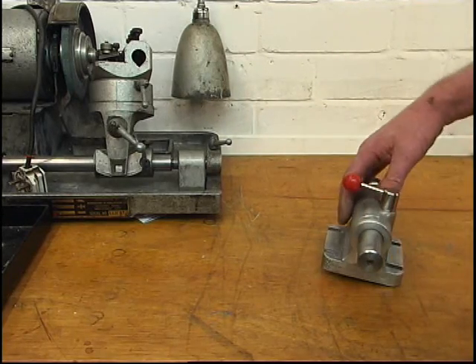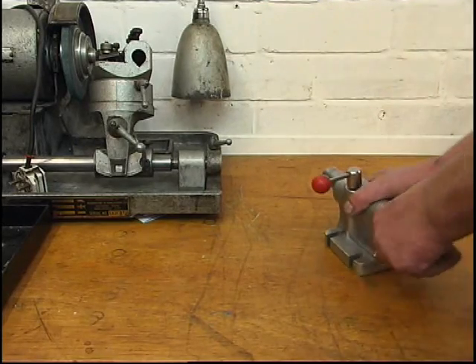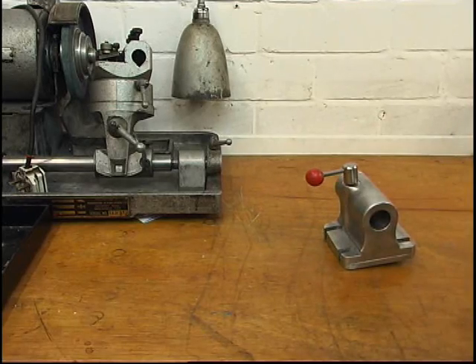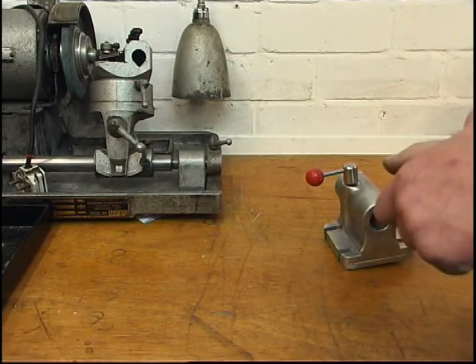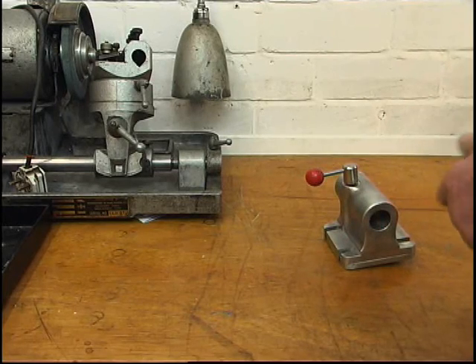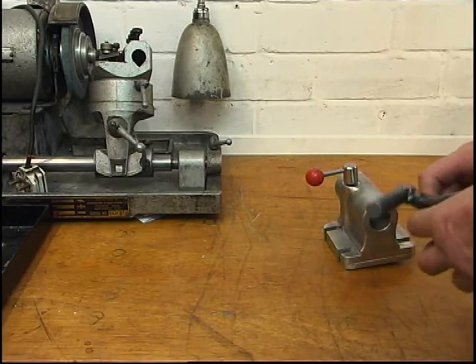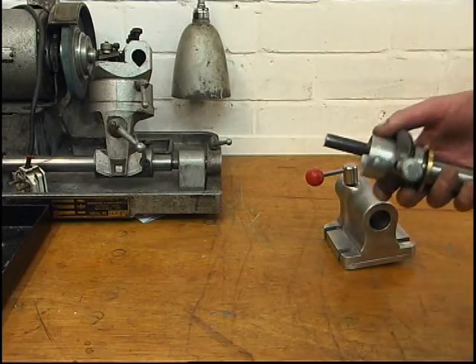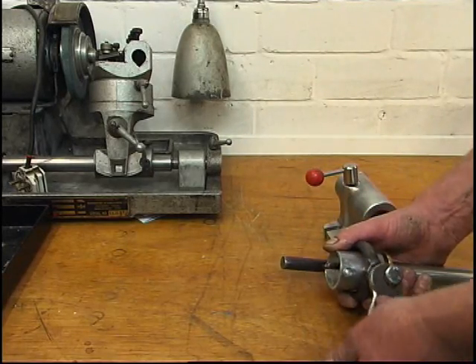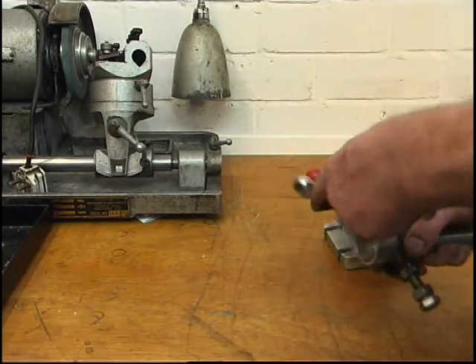I had an idea last night. What I'm going to try doing is take the spindle out and put a lathe dog back on, with a nice thick aluminium pad to protect the threads obviously. That means we can get this back in the lathe between centres, 100% accurate, like it had never been taken out.